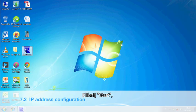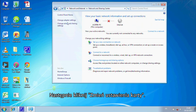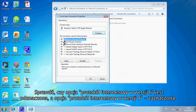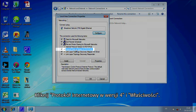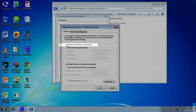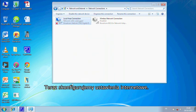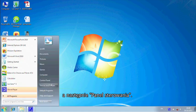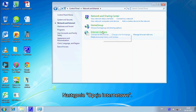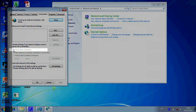For Windows 7, click on Start, then click on Control Panel. Click on View Network Status, then click on Change Adapter Settings. Right-click on Local Area Connection and click on Properties. Click on IPv6 to deselect it. Click on IPv4, then click on Properties. Check that Obtain IP Address Automatically is highlighted and click OK, then Close. Now configure Internet Settings: click on Start, Control Panel, Network and Internet, then Internet Options. Click on Connections, check Never Dial a Connection is selected, and press OK.